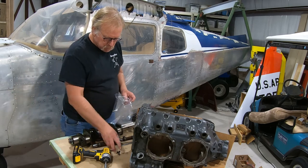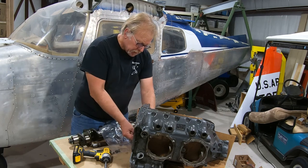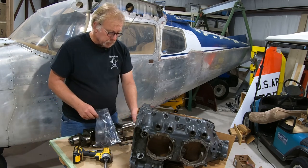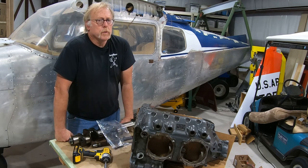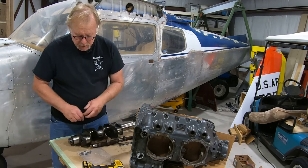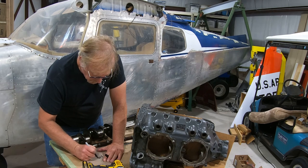Okay, we've got these bolts off. I took pictures of all this before I loosened them up and took them off. Now, you notice I'm using a little impact wrench. I only use that to take these things apart. I never use those putting them together. If you see somebody with an impact wrench putting an aircraft engine or component together, they really need to back away from the aircraft. That's not the right tool to use. But on disassembly, it's not a problem. It speeds things up, and we're not going to hurt any of the fasteners. And most importantly,